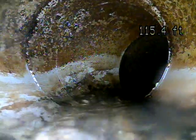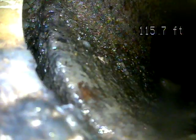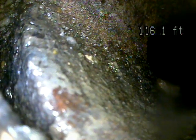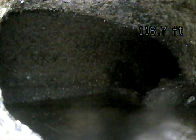You'll notice a little bit of running water — I was running water through a tub to help push the camera out. This first connection point is called the nose-on. That's where it goes from your lateral line into the main city line. Looks like a pretty good connection there, maybe a little bit of separation there. With the angle the camera is coming around, I can't see too much of it, but it does look, as we continue down, that the water is getting through into the city line.